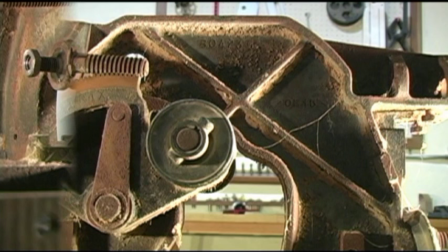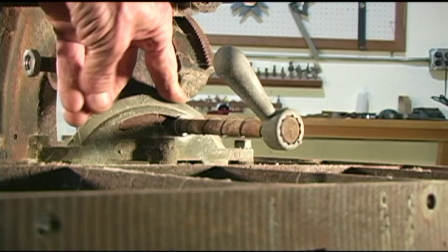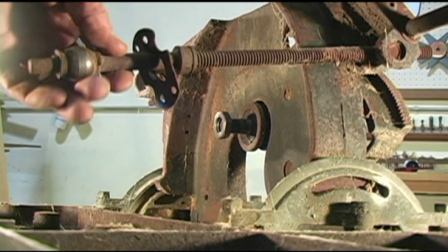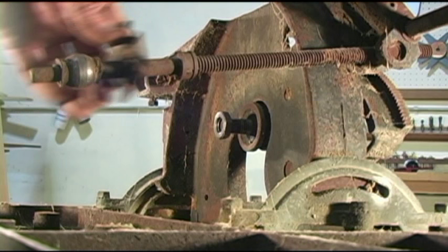Now, this shaft you see here, this knob, is the one near the top front on the table saw. This is your blade tilt lock. This is the blade tilt shaft. And you notice this flange they've got on here. What this does is those two screws from the outside pass through this. And what that does is it compresses this ball on the shaft up against the side of the cabinet.